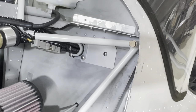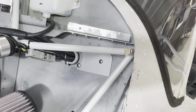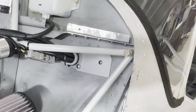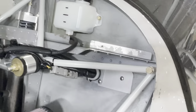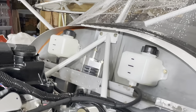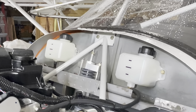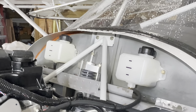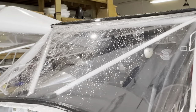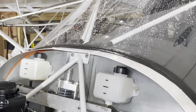The top left and right, or the middle as far as height, is just easy — just put them through. Make sure you have an adequate number of washers if you need to get proper clamping. The top is standard, same as with any other engine: 2-5 size bolts. Make sure they line up with the cage inside before you drill. The cage needs to be centered on the firewall so the whole airplane is not crooked.